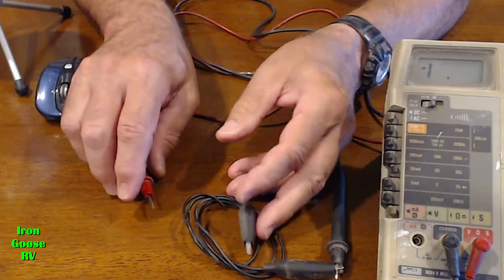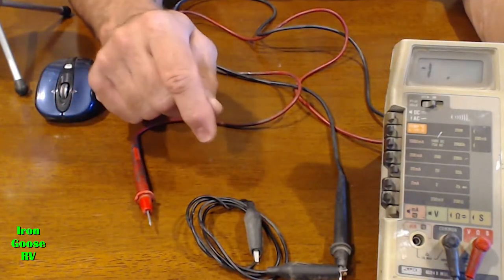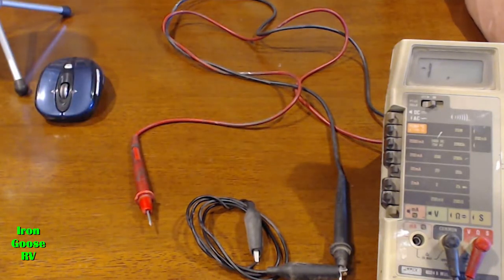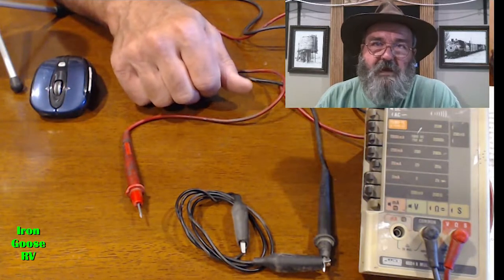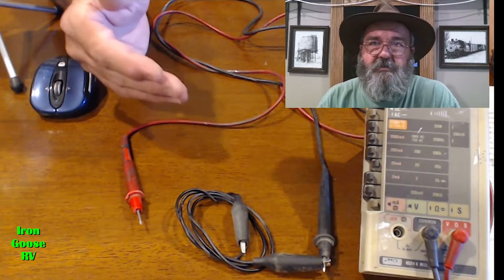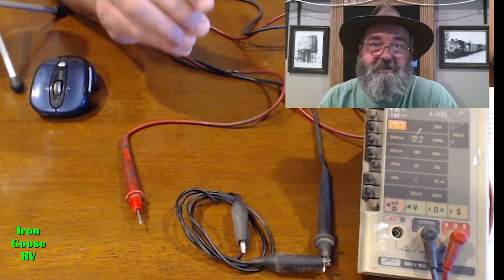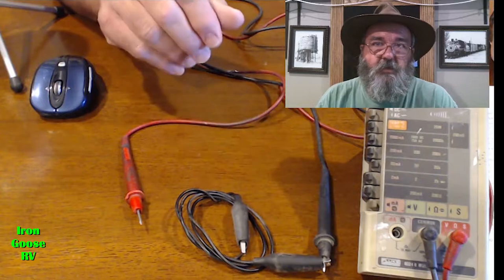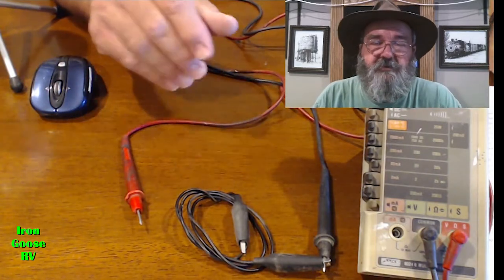Current flow would be impossible through a broken connection, and anything relying on that electrical connection would fail to operate. Now this is the same principle of a fuse in your car, truck, or RV. Your vehicle has an assortment of fuses built into it. Their job is to give a path for electrical current to pass through them and allow your appliance to operate, but at the same time, the fuse is designed to be the weak link in that circuit and open up or blow, like cutting the wire, if excessive current flows in that circuit, stopping all electrical flow in that circuit.